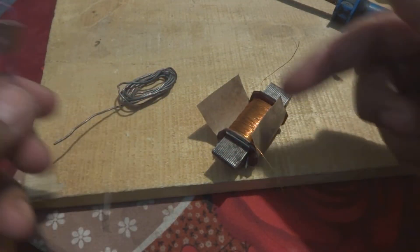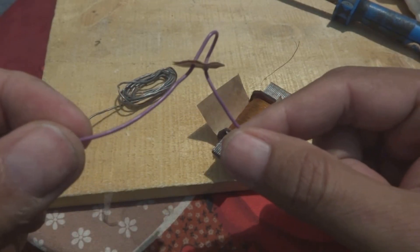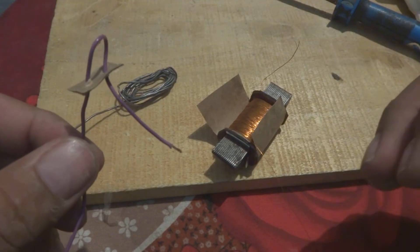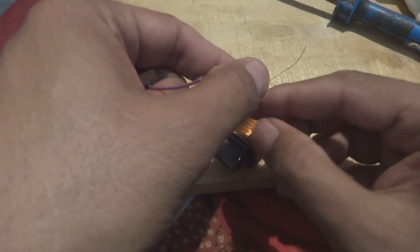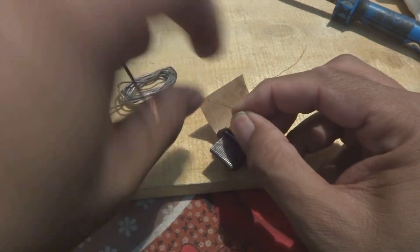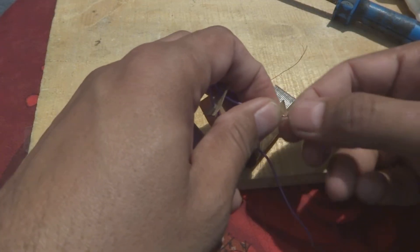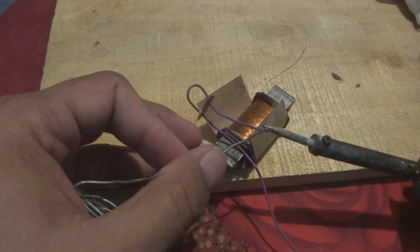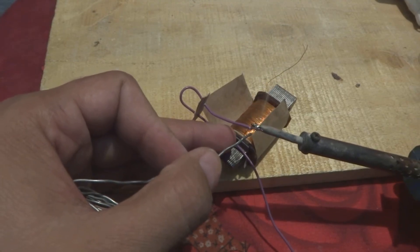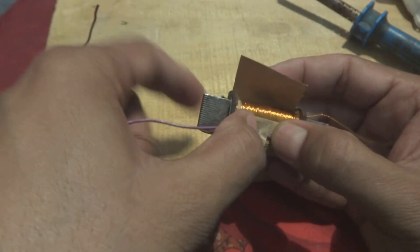This wire — you can see — we will bring a lead off of this winding, so that if it will be producing enough voltage at 1500 turns, this will be our used wire. If it is not, we will put 500 more turns and use that end wire as a lead. So here, if I double this wire, I will be able to make a lead, something like this. Just do it like this, and then with this wire I will bind it on top of a bare copper wire or hookup wire. I will use solder to melt the enamel as well as to do the soldering. With 38 SWG wire, you can do this technique.